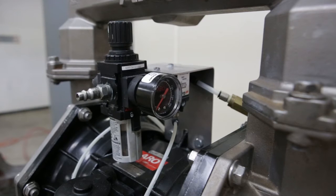When you plug air into the powder fluidization circuit, it's going to feed air into the chamber that was previously pumping powder and fluidize the powder in that cap. This means that when the diaphragm moves into the cap to displace the powder, it won't run into a solid wall of powder. The pump will start and run normally.